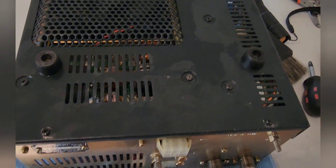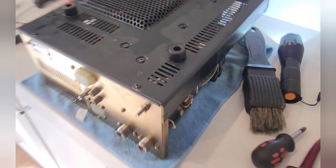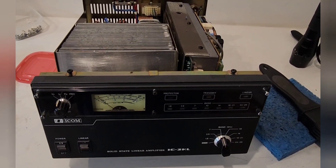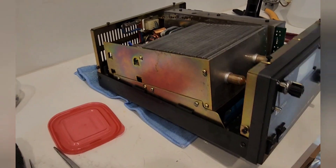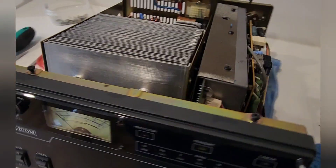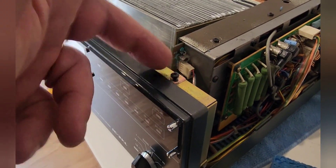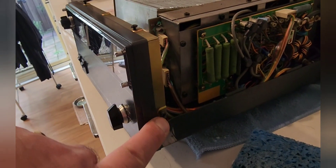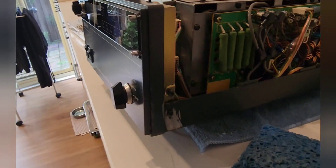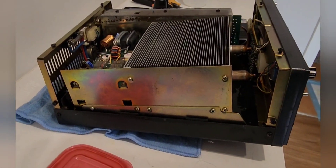I gave this a quick clean, and now I'll just fit the face plate back. All original screw holes have all new screws in them. If you remember this one here — I had to drill it out — I re-tapped that just with the screw. Again, the wrong screw was used. This one here was also a broken screw — that's re-tapped. Working. All M2 screws, all factory — except it's just not chrome.